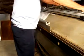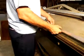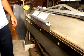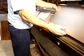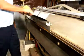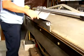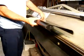Remove the L shim from the T slot and install the J die for an outside radius bend. The J die accepts 3/8 minimum and 5/8 maximum bend for this step. Simply slide the material in from the end and pull your radius as needed. Slide it back out of the end to remove it from the die.